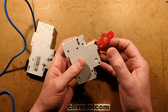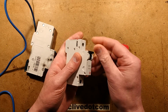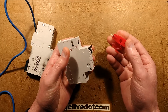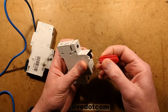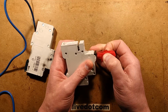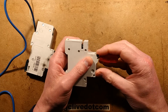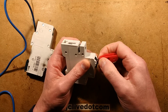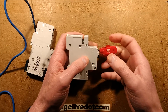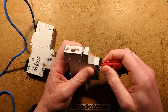While I've got this circuit breaker here, let me show you this little device. If you're still in the dark ages and turning circuit breakers off on a distribution board and putting sticky tape over them to stop people turning them on, you may want to invest in one of these. There are various types for different breakers. You squeeze it together, put it in, close the catch down, and put a padlock through it. Nobody can open that without brute force. You can use it to lock the breaker off or lock it on. If you lock it on and there's a fault condition, the breaker can still trip internally — it won't be prevented from going off. The idea is basically to stop you being electrocuted when someone turns power on to something you're working on. This is in the lockout/tagout sort of zone of things.